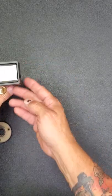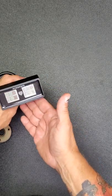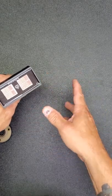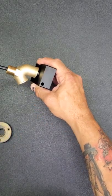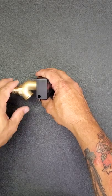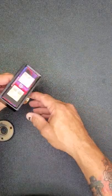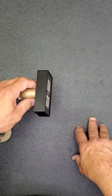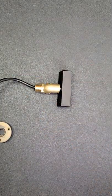Using the Medusa as an example here, it's not going to be hanging down below the bottom of the boat, which you obviously do not want. Read your instructions — we won't touch on that in this video, but the instructions will take care of that situation. Your drain plug goes here, the light is permanently installed, you just leave it, drain your bilge through here, and you never have to remove your light.